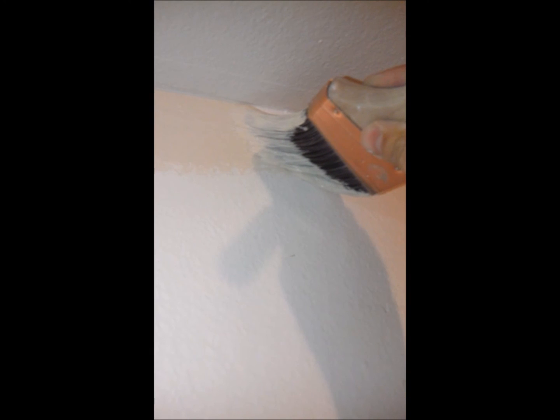I'm going to show you how to cut in a ceiling without using tape. Use the same cutting-in technique as I showed you earlier — just push the bristles into where you want the line to be. As long as you don't go up past that crack, lay this out so it doesn't drip on you. See that line in there? It's called a rope. You want to lay that out. If you continue like this all the way around, it looks like you taped it, but in reality you just cut in all the way up to it. Enjoy!